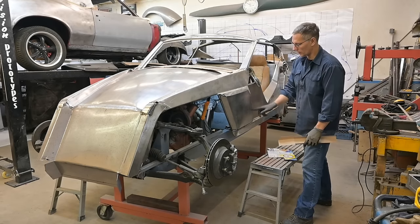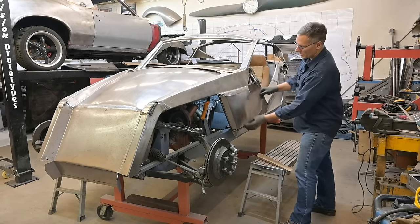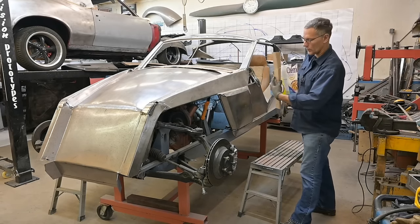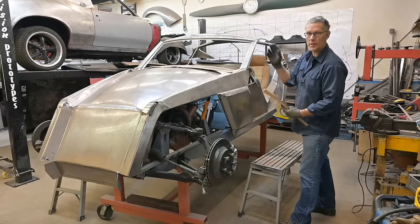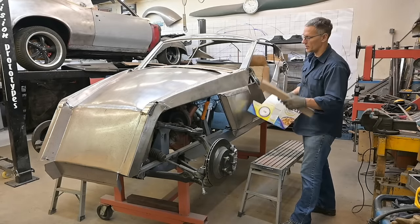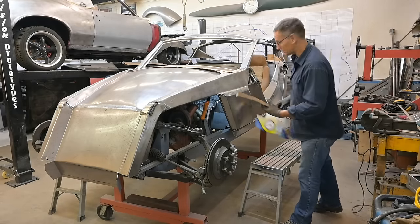So we're gonna take a roll of flange inward and then use this template. And it's gonna sit on the inside, tie into the exterior perimeter, and this channel will then weld to this inside skin and work its way up into that structural web that goes across the hood to the other side, where we'll have to create one more of these and one more of these to tie everything together. So let's get some sheet metal out and start building.